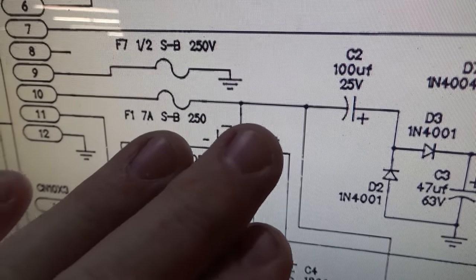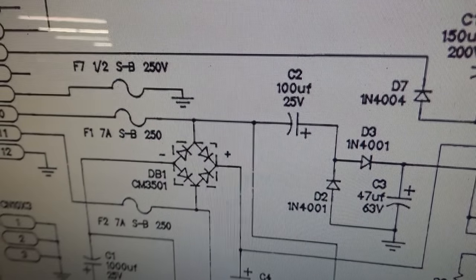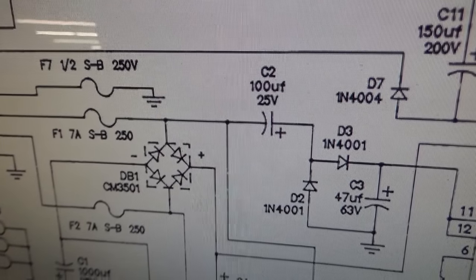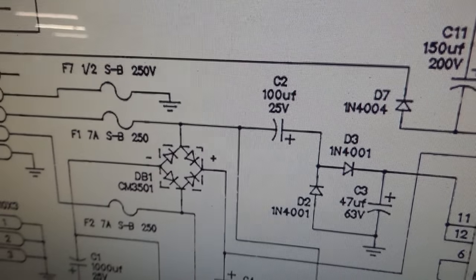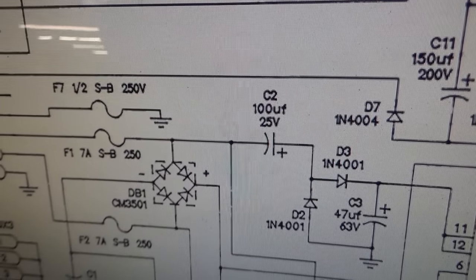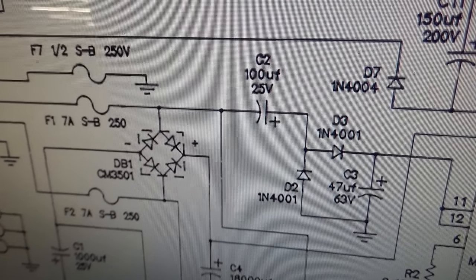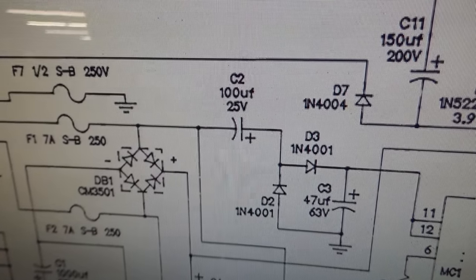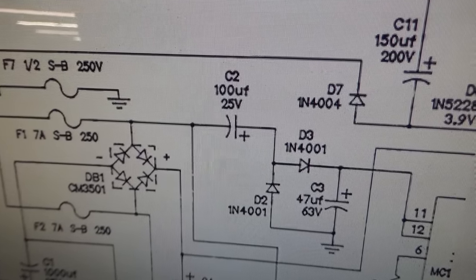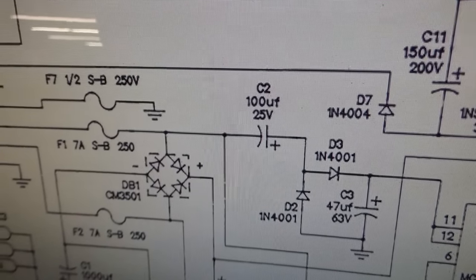But if you take that out of the equation, one of those AC voltages goes through this cap. The cap has water in it. The water had all leaked out. It's called an electrolyte, but it's like water. You know how you drink that expensive water that you get at the hippie grocery store and it says with electrolytes? That's what they're talking about. So the electrolytes had leaked out. So this cap wasn't doing what it's supposed to do. This thing is like licking a 9-volt battery with your tongue, right? It stores up the juice and makes it worse because of the water in it.